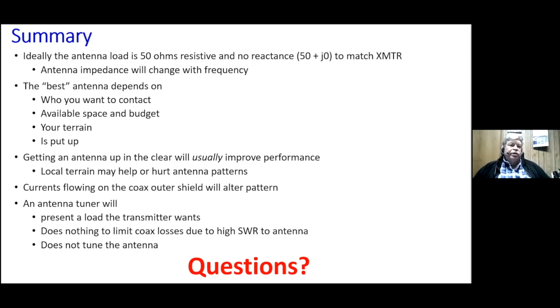I mean, when they invented coax, they made 75 ohm coax, and there's even 100 ohm coax and 35 ohm coax. And if you notice, like cable TV, you have 75 ohms. The higher impedance, because of the construction, is lower loss, but 35 ohms can handle more power, and you want to have low loss and handle power. So they kind of settled on 50 as a compromise. And like you said, you can make wire feed lines just about any impedance you want.